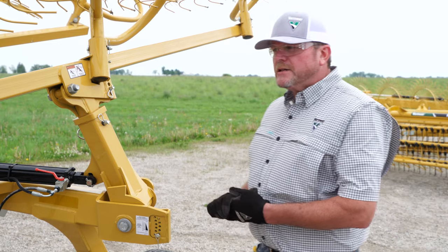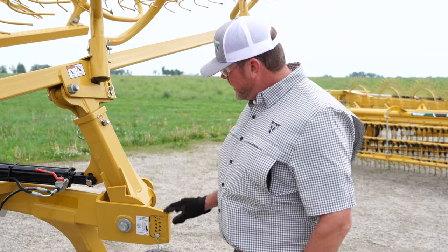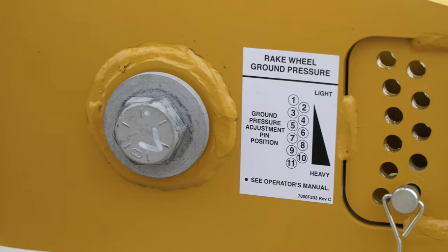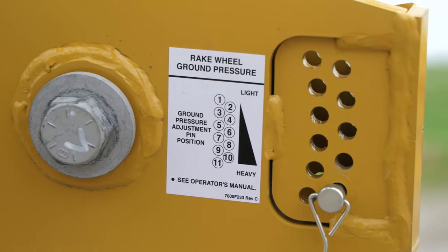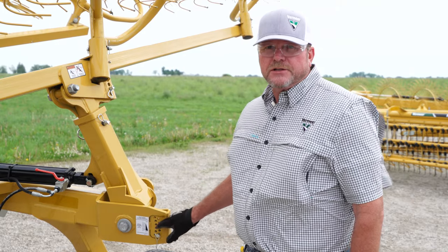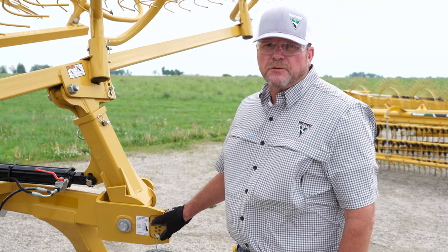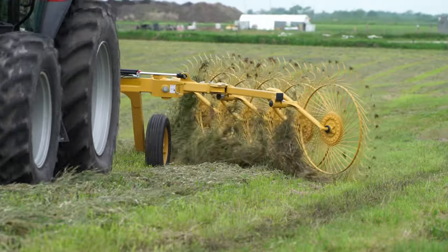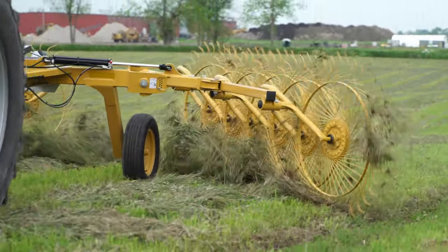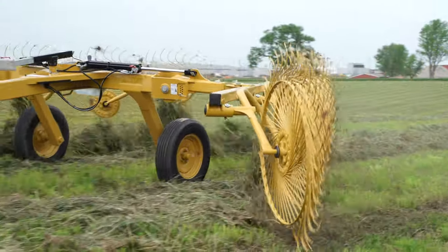Now that we've talked about the hitch, we need to think about what reasons might be causing our teeth to dig the ground on this wheel rake. We have to consider how much pressure we're putting on each of the rake wheels. You can see we've got a range of holes to choose from and the decal explains lighter to heavier settings. You can see the wheels in the front are really digging into the ground — our pressure is not set correctly. The wheels in the back are trying to ride up, which is another indication that we don't have the correct pressure on the rake.